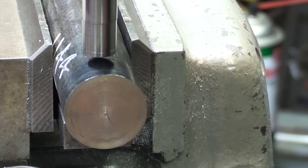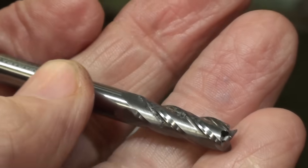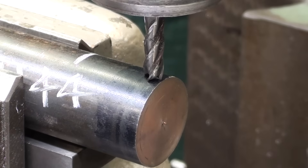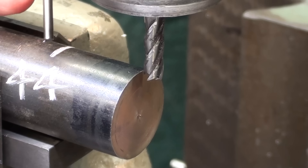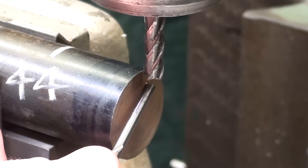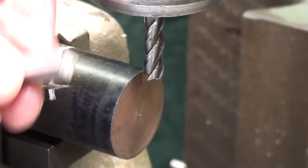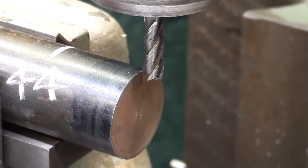I'm going to use this beautiful little Niagara Cutter, quarter inch, solid carbide. What I'm going to do here is touch off, then back off, and take multiple passes up to the white line until I get to a depth of 718 thousandths. How did I find that dimension? It is the radius of the work, plus half of the thickness of the key, which is one eighth of an inch. So I've added 0.592, plus 0.125, for a total depth of 718 thousandths.